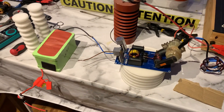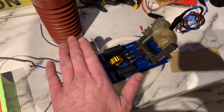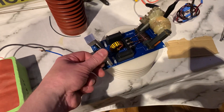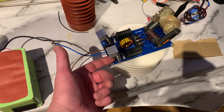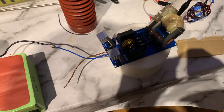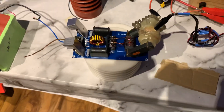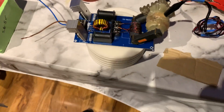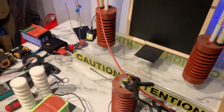24 volts, 26 volts — whatever's going into the little ZVS — and they're freezing. It's been 10 minutes but they're cold anyway. They don't get hot because I changed these to IRFP260N MOSFETs, which are about 200 volts at 60 amps each. It flicks between the two really. Anyway, let's get on with it and see what happens. Turn the light off.